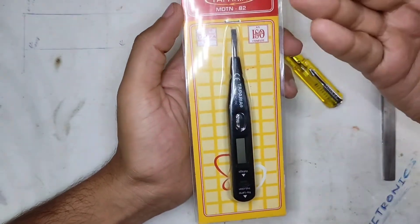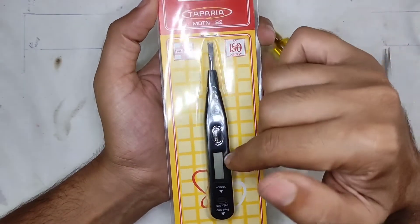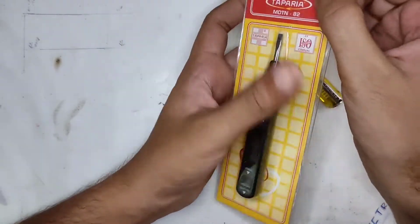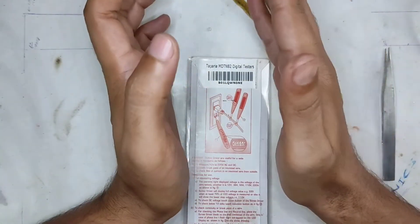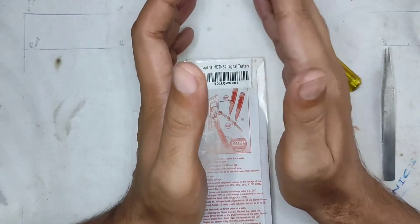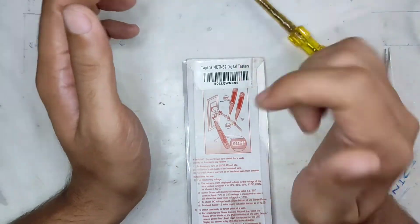For example, if the actual voltage is 100 volts and the measured voltage reaches 70% — that is, 70 volts — it's going to display 100 volts on the screen. If the measured voltage is less than 70 volts, it's going to show the next lowest digit, which in this case is 55 volts. So if you're measuring between 55 and 100 volts, whenever the voltage is above 70 volts it shows 100; if below 70 volts, it shows 55 regardless of the exact value.